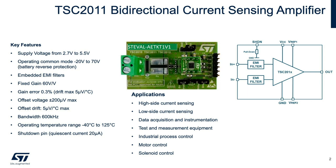Some key aspects of the block diagram: with respect to the EMI filter, current sense amplifiers are commonly subjected to changing input offset voltages caused by electromagnetic interference, and the EMI filter minimizes susceptibility to this phenomenon. The TSC 2011 enters a low-power shutdown mode when the shutdown pin is pulled high between 0.7 of VCC to VCC — this is an active low current sense amplifier. Connecting voltage reference 1 and voltage reference 2 to VCC, ground, or a combination will set the unidirectional or bidirectional current flow configuration. More discussion on settings to follow.